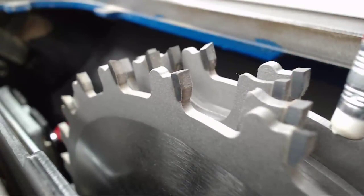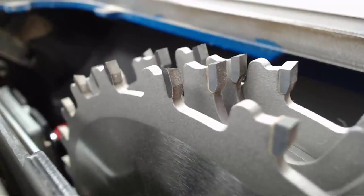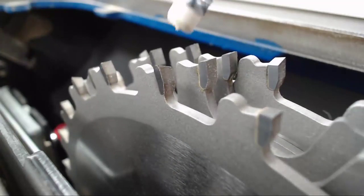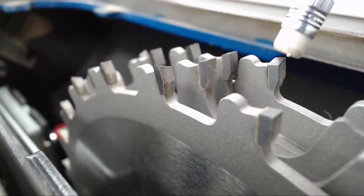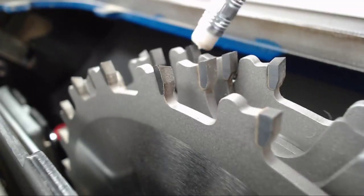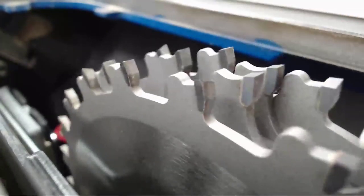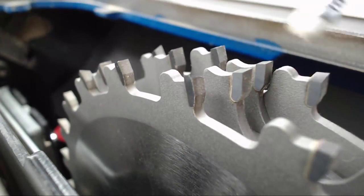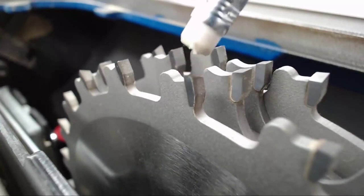There you go. You can see as I'm turning, all of the chippers are different widths. Now, each one of these chippers has got 4 blades on it, so it's very, very well balanced. And right across the center, I've done a little test cut earlier, all of them are dead flat, absolutely dead flat. The outside blades are designed to have a slight peak on them, and the second part of that blade is flat. So this one's got a peak out this way, and this one has a peak this way. Now, it's only very slight, and you'll be surprised how good it is.